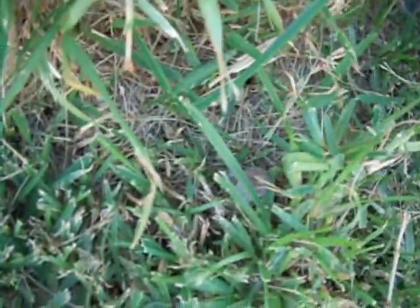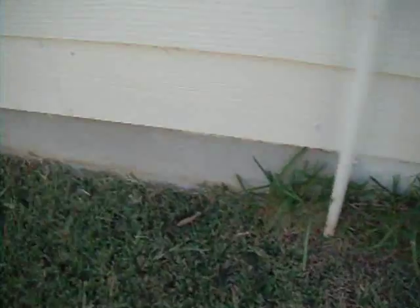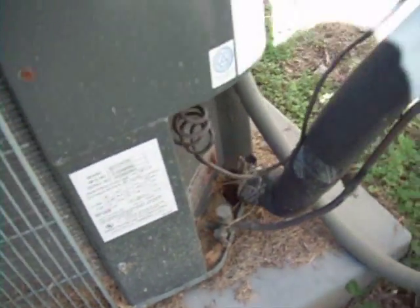This is the grounding bar and it's on the outside below the meter. Let's look at the air conditioning unit. We're at the air conditioning unit — it calls for a 50-amp breaker and this one calls for 25 amps, so they're both correctly fitted. This is the main electrical panel with the front cover off. Here we've got the grounding bar; over this side we've got a neutral, and grounds are attached to that as well. Down here we have arc fault detectors, which are correct. No holes in the bottom — the wiring is in good condition.